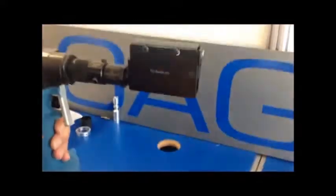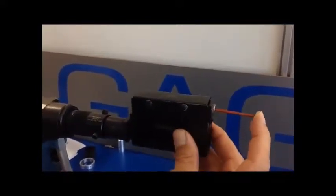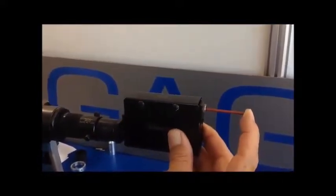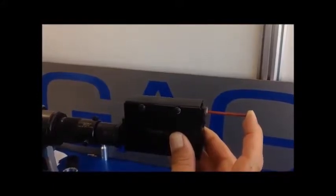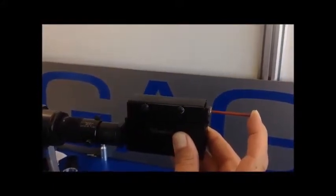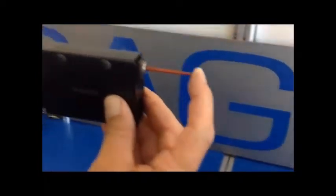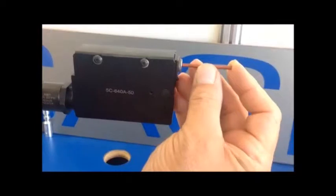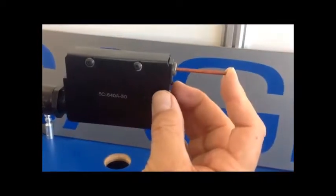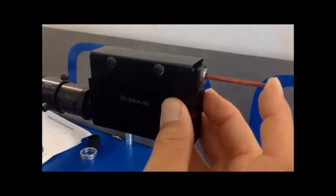Using your setting gauge, insert the short end of the setting gauge into the outer anvil until the inner face of the gauge collar rests against the end of the inner anvil and the anvil rests on the crossbar and sleeve. The outer face of the collar should be approximately ten thousandths above the face of the inner anvil for countersunk nose assemblies. Right now we are using a countersunk nose assembly and installing a protruding head fastener, so the gauge should rest on the outside of the inner anvil. As you see right now, the gauge is actually resting on the inside.